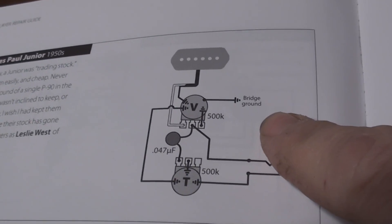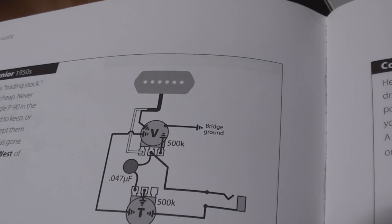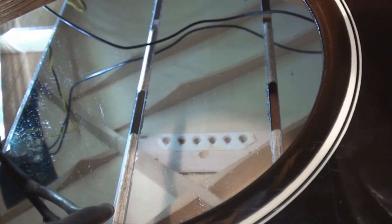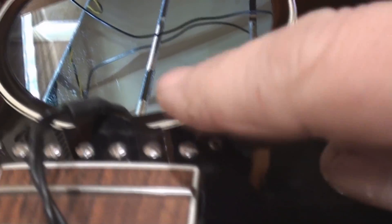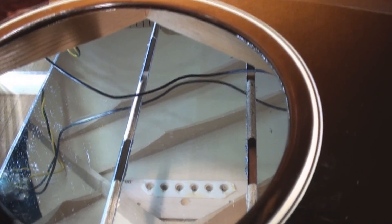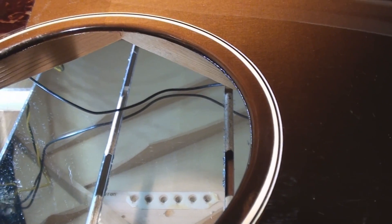This is what's inside this guitar, and it clearly shows a bridge ground — and that's what that black wire is. That's the remnant of the double-sided tape that was holding a metallic strip in place that the black wire connected to in order to ground the strings. There are two important reasons to ground the strings: one is the strings will pick up noises and transfer that into the pickups, and the other reason is if you've ever gotten a big shock off of a microphone, or there's some sort of grounding issue with the equipment you're using, there's a chance you could get really electrocuted and shocked severely.